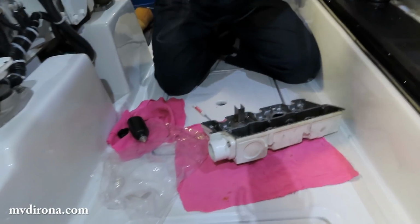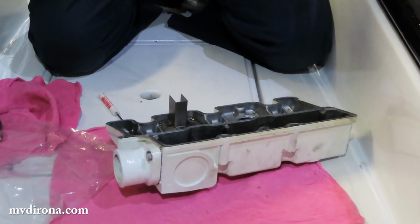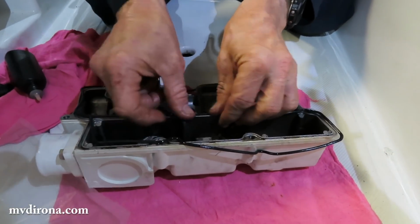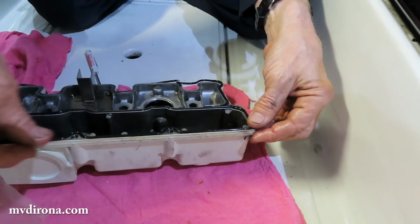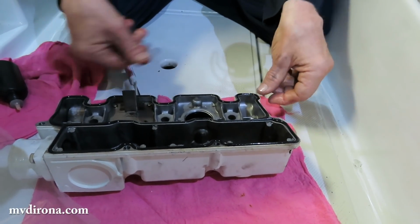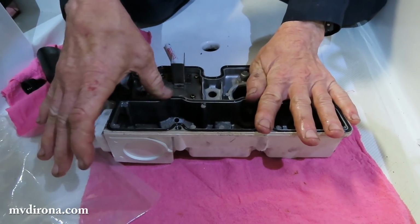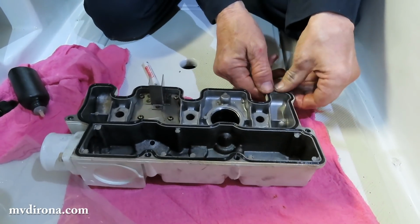So that's just a light engine oil you've got in a little bottle there? It's just standard engine oil, 15W40 standard diesel engine oil. Okay. So there's a more complicated shape here and a nice slope there, which tells you that's the way it goes. I normally just gently set it in and let it find its place, and then I'll push it into the final position. And the oil helps you with placing it easier? The oil's mainly there so the seal doesn't get damaged on installation and clamping down. It doesn't end up taking wear or getting cut.